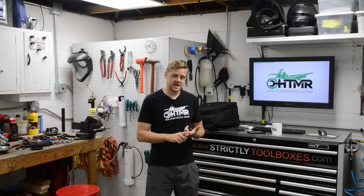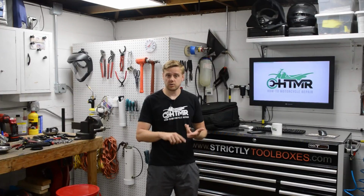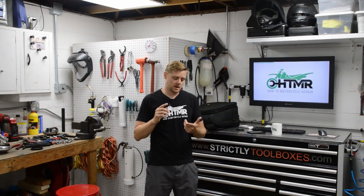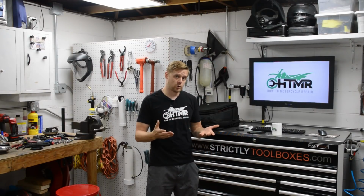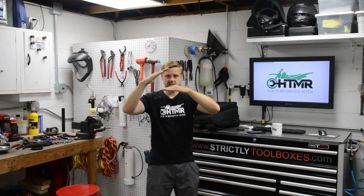Okay, I want to talk for a minute about sizing of the unit. The unit I got is 18K BTU, and they make a 12, 18, a 24, and I think a 36, and probably some others. But anyway, on their website, they have some general sizing requirements. For example, 12,000 unit is good for 500 square feet. Okay, I went slightly larger. This garage is about 480 square feet, but the reason I went with a little more BTU more cooling is because my garage has an open ceiling.